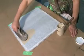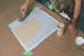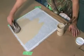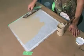Begin by priming the surface with our Versi-Lime Quartz Primer. Sand the primer when it has fully dried. This will reduce the amount of plaster necessary to cover the orange peel effect created by the primer. Now apply a loose coat of greenstone to the entire surface.